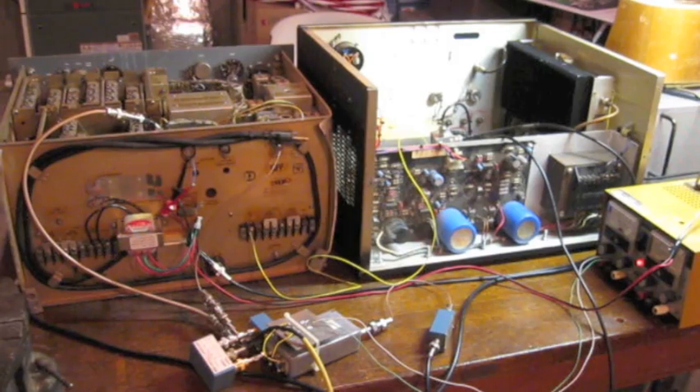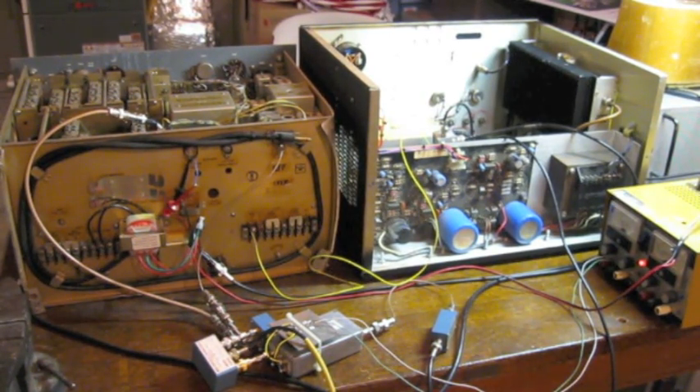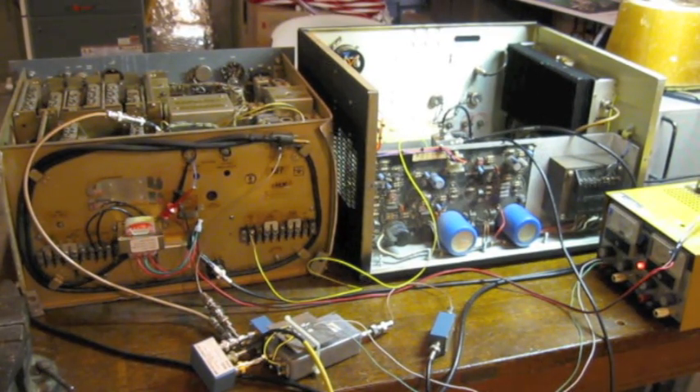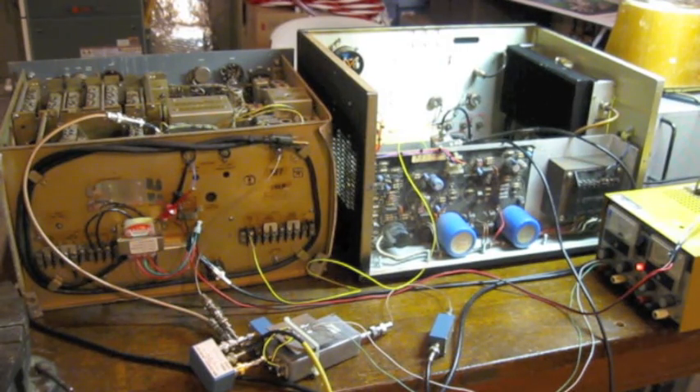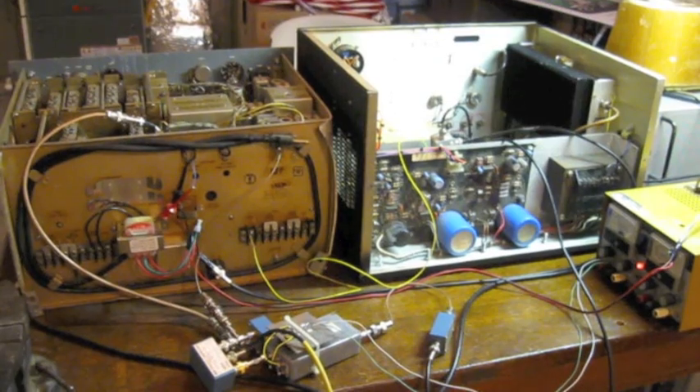One of the extra legs on the relay was tied to ground, and this wire was fed over to the break-in, so when you hit transmit it does break-in and mute the R390. The relay's coil was wired into the PTT circuitry of this radio — when you build and design radios yourself from scratch, all these things are very easily accessible. That is how the R390A is acting as a transceiver. This procedure is so easy to implement that you could probably buy an old transceiver from the seventies and easily hack it to do just this and cover all the bands. This transceiver only covers 20 meters, but with an old Kenwood or Yaesu from the seventies I could easily turn this R390 into an all-band transceiver. Next we'll make several contacts on the R390 transceiver, including DX contacts including the Azores — should be a lot of fun.